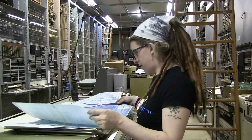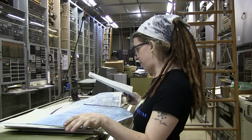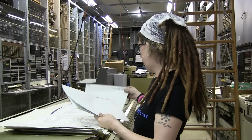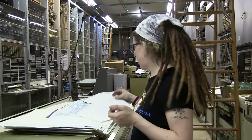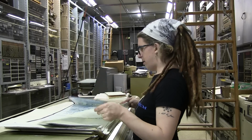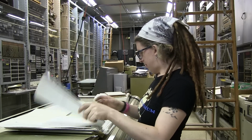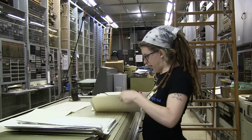Okay, I got the relay in. I had a bit of an oh shit moment because I realized that I previously put a resistor in way back, like a couple weeks ago, and that resistor was connected to that L relay, but since there was no L relay there, the resistor wasn't doing anything. But my mistake was that the resistor I put in was not capable of handling that dissipation of current.